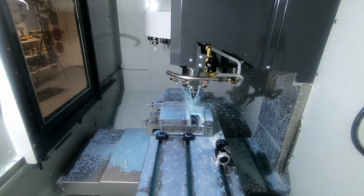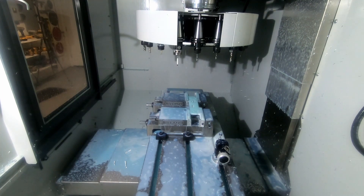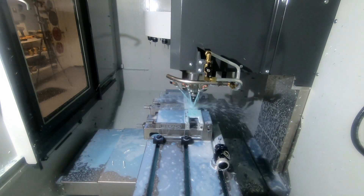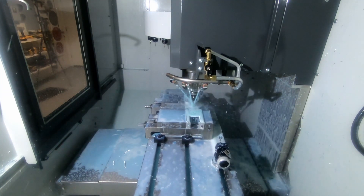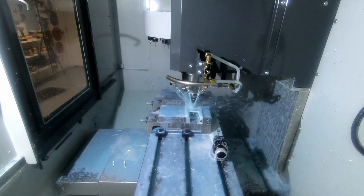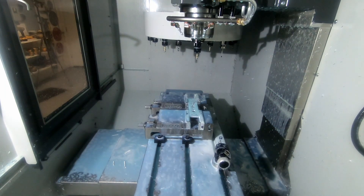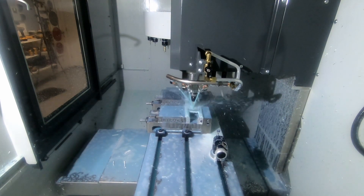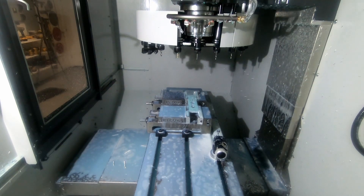It's hard to read the number here, it keeps jumping around. Feeding at 14 inches per minute for a feed rate of one and a half thousandths per tooth, which is the recommended value for high-speed steel. Now I'm going to be ramping into a rough cut with the Lakeshore Carbide aluminum shredder — a roughing tool that makes super fine chips. My toolpath produces absolutely no chip buildup on the tool. In the past I had a problem with that tool and operation, and had to try a bunch of different combinations to get it to execute without building up a rat's nest of chips.